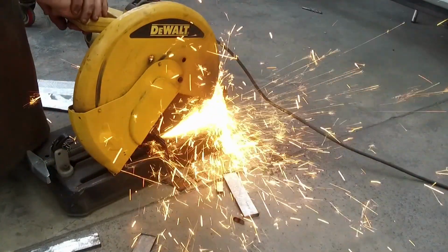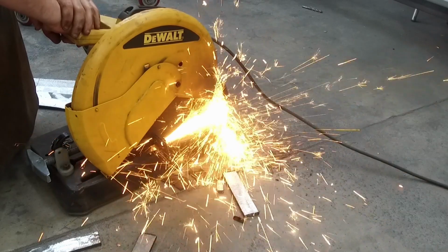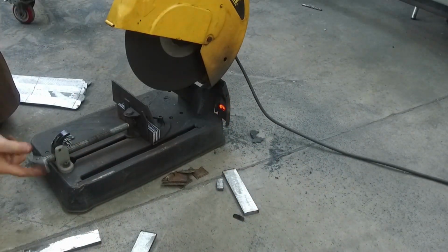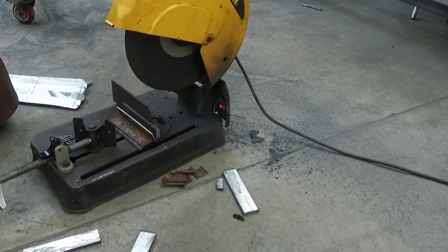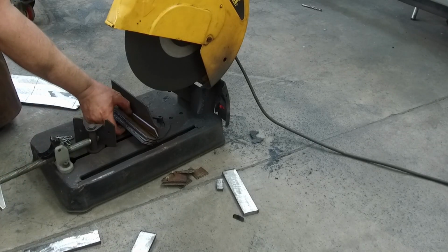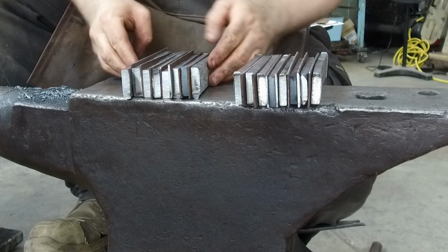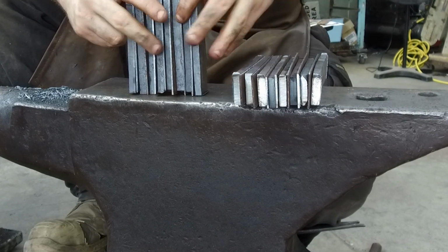My plan is to assemble essentially a steel sandwich with the construction. This is going to be an alternating set of layers where I've got chain meeting a piece of bandsaw steel, and then another piece of chain meets another bandsaw steel, and that'll approximately give me around maybe 18 layers, which will be quite good.